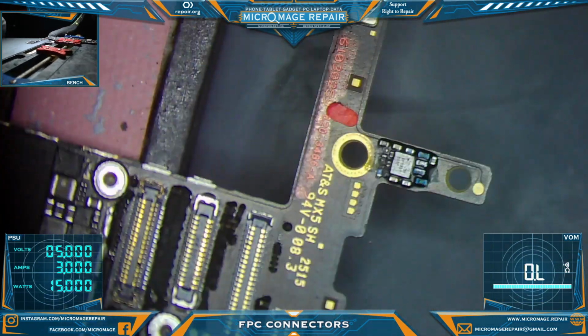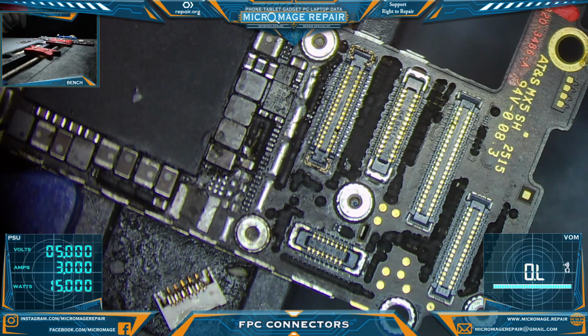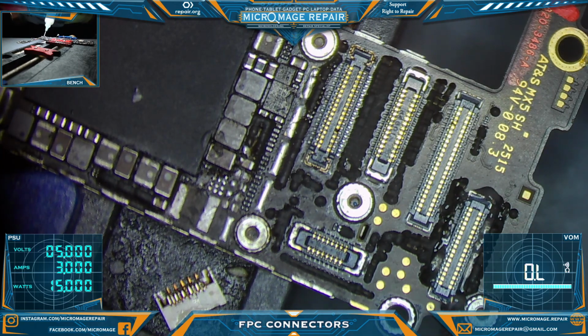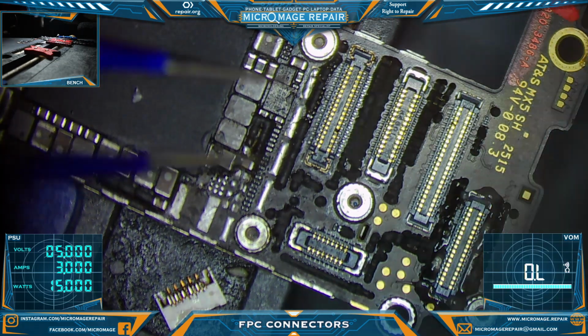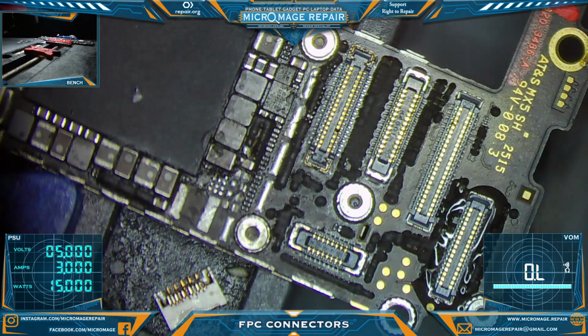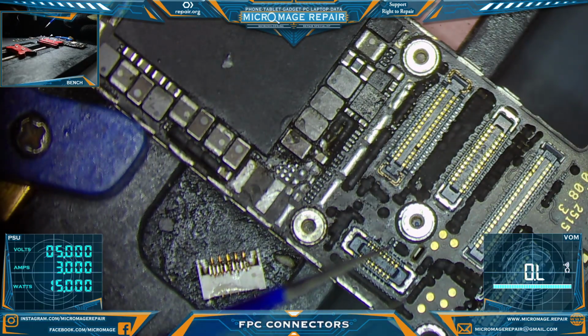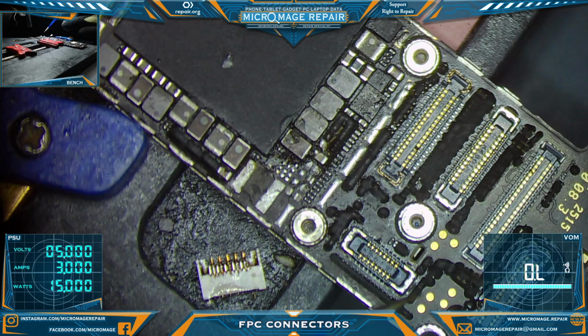Okay. With pulling them, it's all really about timing. You want to take the air off immediately when you're ready to pull. You don't want to be blowing air on it once you have pulled it from the board and the board is no longer able to disperse or mitigate the heat. I also use a lot of nozzle movement. You generally don't want the hot air to be in one spot for very long.